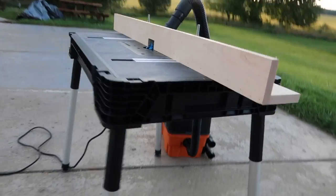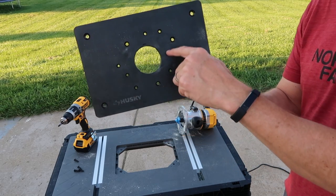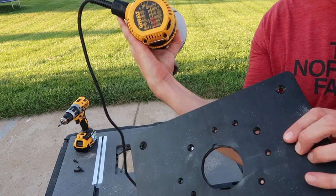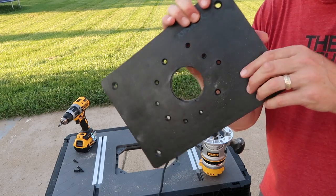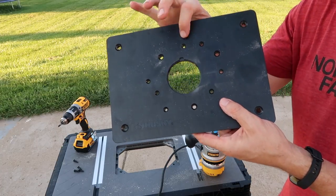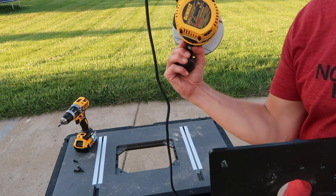Underneath you can see the router is hooked up, and for dust collection I have the Ridgid Pro Pack — you just set that right there and it does a great job. The plate for the router has all these different holes so you can fit it on several different routers. I did see some people online saying they had a hard time fitting it, even some DeWalt ones, but I have the DW618 and aligning the holes was a little tricky at first — kind of like aligning Mars and Venus — but it does work. I'll put a link below so you can find out which routers it fits. It definitely works with the DW618.